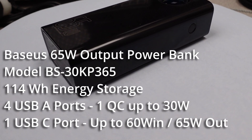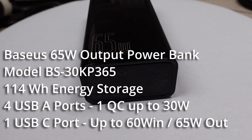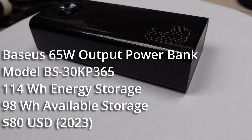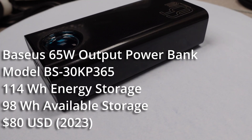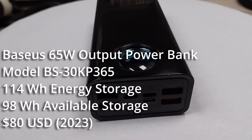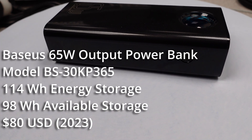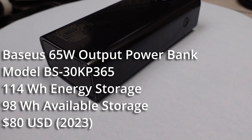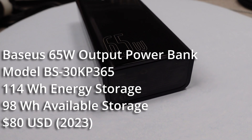The many USB-A ports are great for charging lots of 5 volt devices. I can see this being very useful for keeping a GoPro active for a long period of time, or charging lots of phones at a moderate speed, or just having lots of energy in a reasonably lightweight power bank for the amount of energy stored. The USB-C port can deliver the full 65 watts no problem, but not with any other devices connected. The output capacity is near 100 watt hours, which is really good. If the charging was a little more efficient, I'd really like this power bank. The price point is reasonable — around 80 US dollars as of 2023 — and it does go on sale fairly regularly. I expect the device to last a long time and be capable of a lot of charge and discharge cycles, especially since the battery never really has to work that hard.